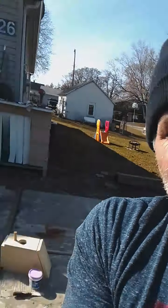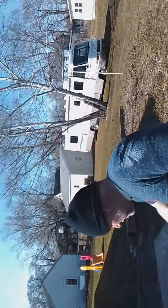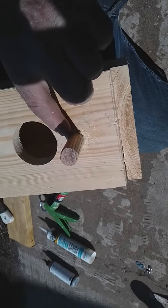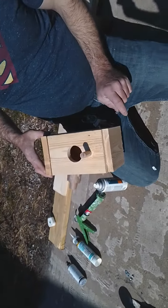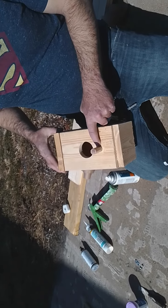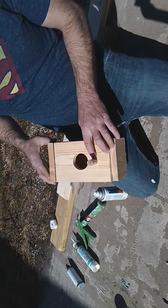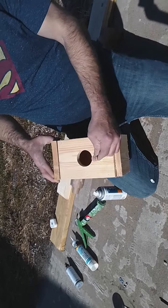First, what we did is we got some of the materials that we needed. We used a three-quarter inch dowel — it's a wooden dowel — and we made a three-quarter inch hole in there. Then we cut the dowel down to about two inches and we glued it into the hole. We didn't drill all the way through because we wanted to have something for it to be against. We let the glue dry and now we've got a really solid perch for the birds.